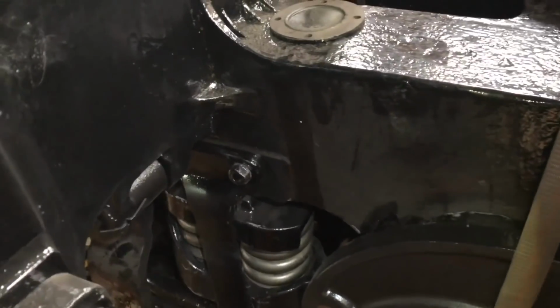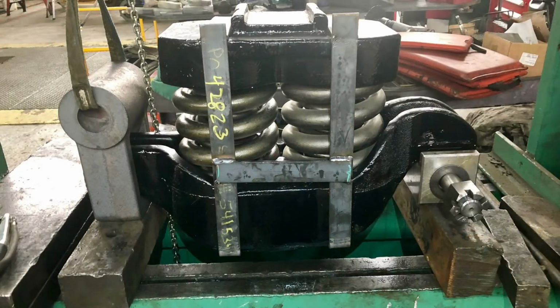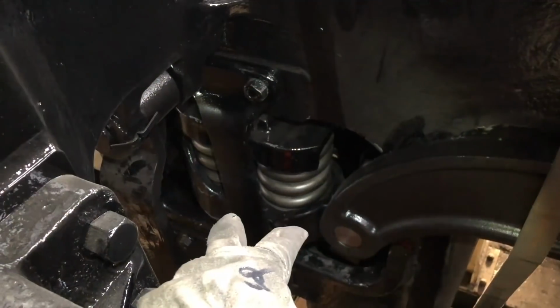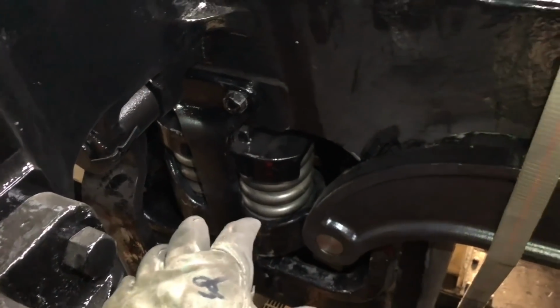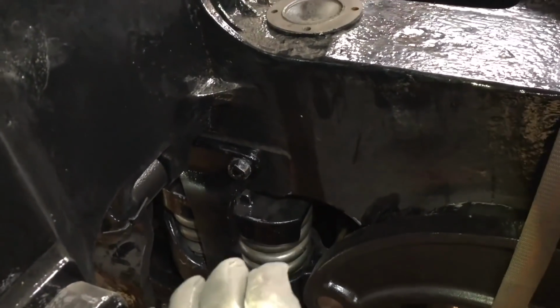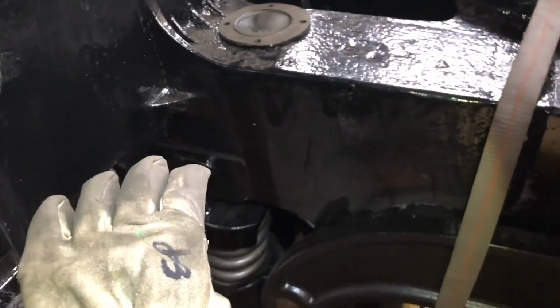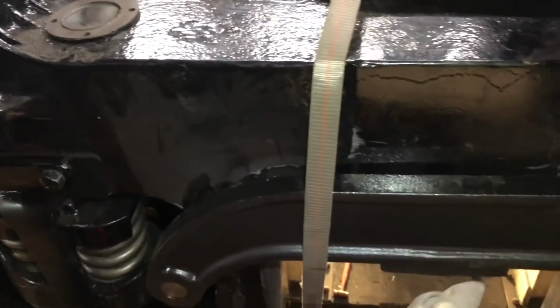And you can see in place of this leaf spring, you have a coil pack. And that's 2 inner coils and an outer coil and a double set. And this is what spans the driver. So the coil springs are absorbing the shocks and transmitting the load of that frame point, dividing it to the other frame point and transferring the weight on this particular driver.